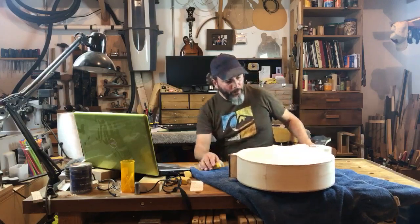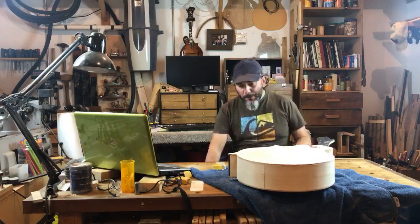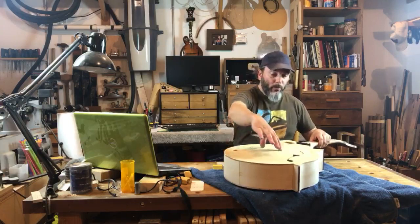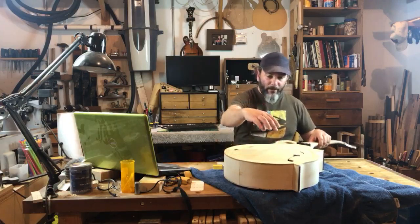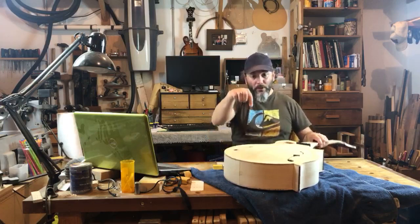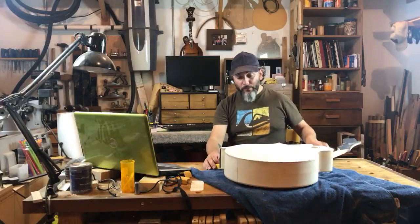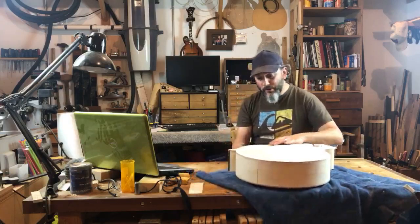There's another article, for archtop, that's similar to tap tuning, and once again I'm not sure who wrote it, but it was about deflection. Basically they had the strings on top of the instrument, and the back wasn't attached, but they were able to put some pressure on it and see how it deflected with little gauges. When they had the proper deflection, that's where they stopped carving the back brace. So that was another way, by measuring the rigidity of the plate, to tune or maximize the response of your plate. But then again, you have to build quite a few to be happy with what you have. So once again, it's just a point of reference.